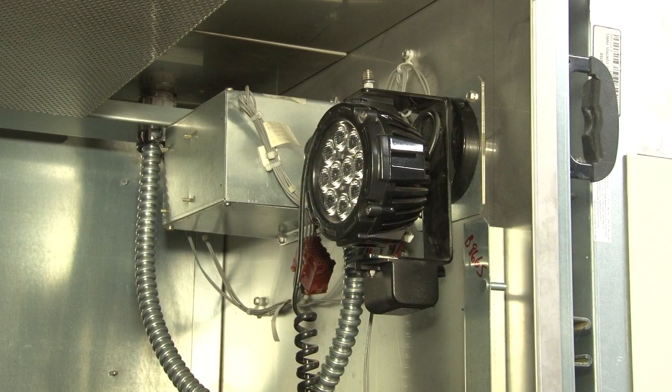If you have an issue with it, there's a transformer inside. Check to make sure that the power's good coming in. Check it going out. And if that's bad, you know your transformer's bad. There are connection points down in the actual unit that are mostly Molex plugs. Sometimes if a wire comes loose, they're just little prongs. You may have to pull them out and reinsert them. For the most part, I've gone through every one of them and they're all good. The connections are tight on it.